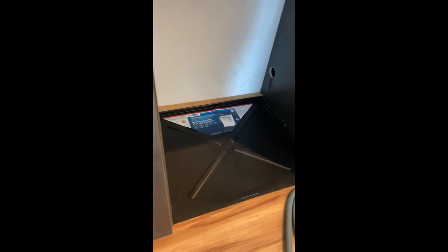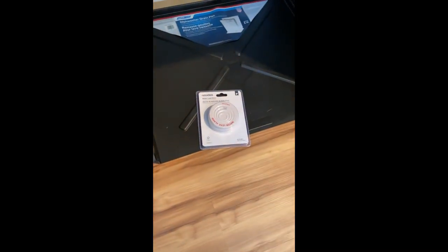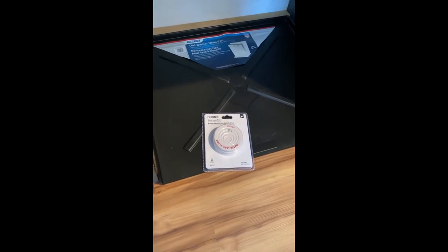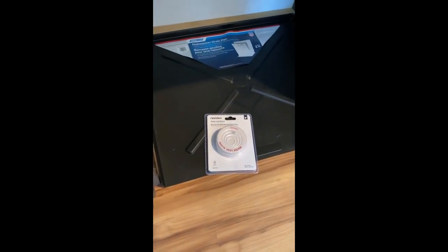What I've done is ordered one of these dishwasher pans off Amazon to fit in the bottom — that way if it leaks, water will go there. I also got a leak detector off Amazon. It uses a nine-volt battery that lasts two years; I'll probably change it out every year just to be safe. Behind this pad I cut a two by four.